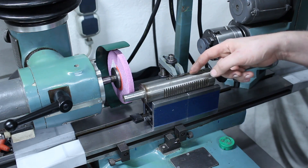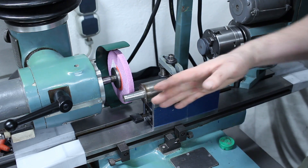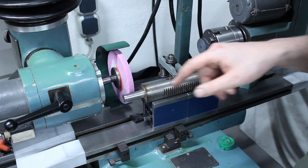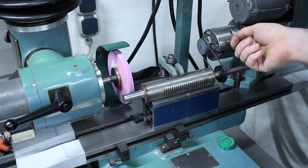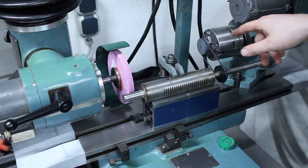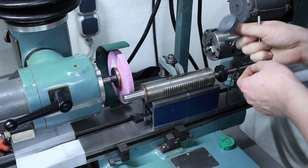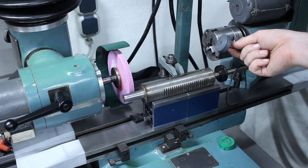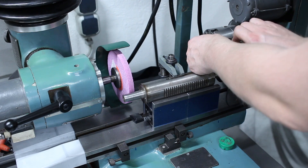There's a key here in the key slot so as not to damage the outer diameter of the quill. We're driving the spindle via a large O-ring and two pulleys from the motor-driven workhead — a motor-driven workhead with a three-jaw chuck. This is just a pulley with a dowel pin as a shank; I made this some time ago when I reground a live center for a lathe, so I could drive the live center with a drill motor.